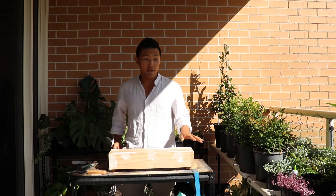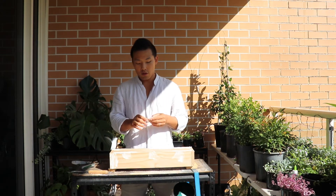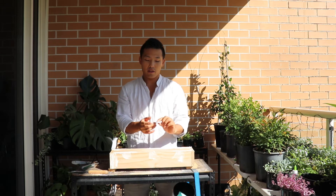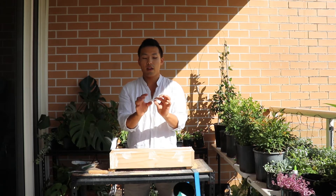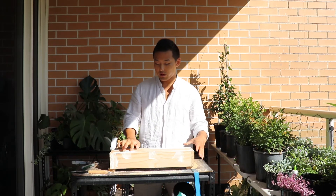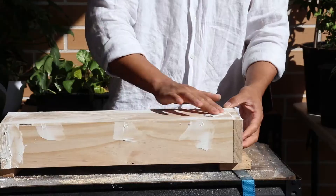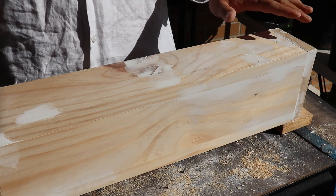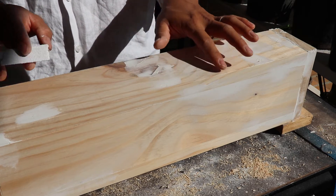Okay, now it's been dried out, so I'm just gonna start to do sanding again. When you do sanding, all you need to do is grab a piece of sandpaper and then fold it in thirds, just fold it in half for size. With two fingers, grab it and put it to the edge. When you do sanding, what you really need to be careful about is you need to be more focused on the edge area.